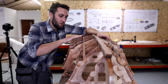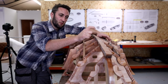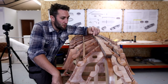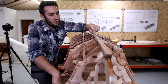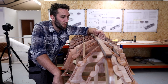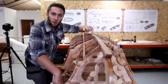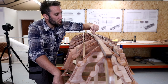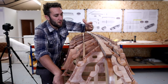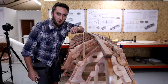With our stringer we had notches already in place where they've gone around the frames. With the keel we haven't got that because the frames are notched for the keel, not the keel for the frames. So what we've got to do is cut some little markers in there that are going to give us that same position at each station to get our shape sorted out. First I'm going to knock the epoxy off the outside of this keel because what we really need is a nice center line down the middle that we can keep as our reference, so that we know where we're at as we bevel each side off.